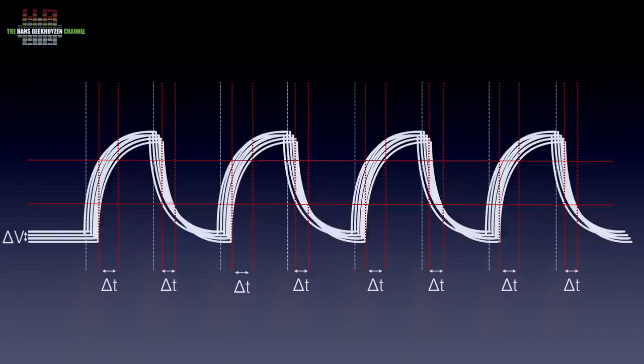Let's make the deviation more visible by copying the distances between the vertical lines to these green dotted lines and moving them to about the middle of the jittered signal of the first half cycle. Now look at the other cycles and you see a nice stable clock is gone. This is a relatively static representation — in real life all parameters can constantly change. But normally this would not harm data integrity during transport or storage.